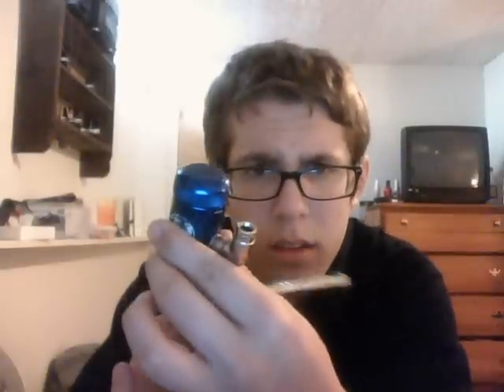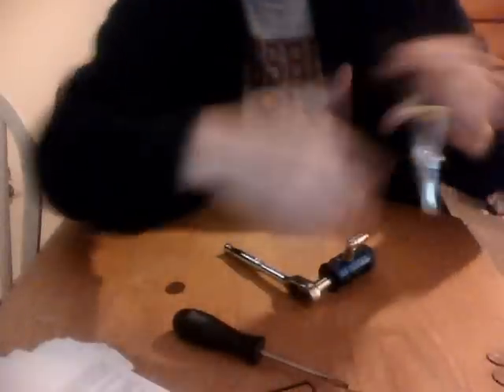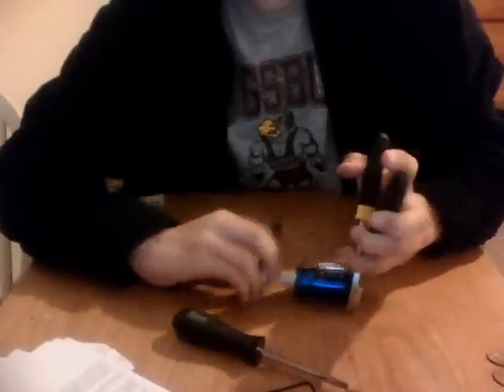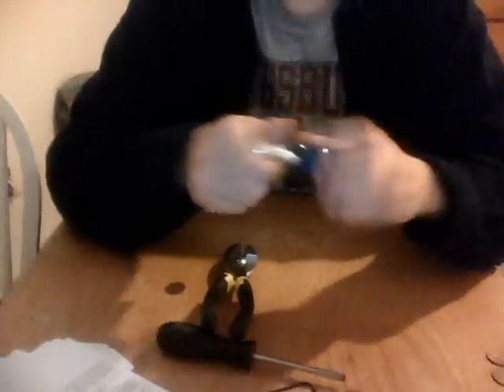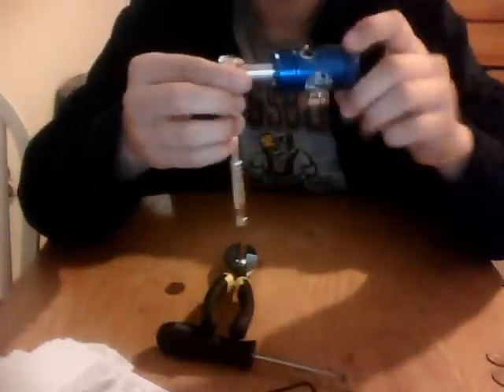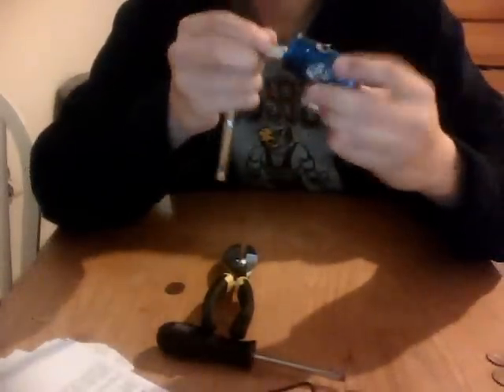You're going to take it and you'll see that it spins. So you stick that in there, take your pliers and hold the knob. While holding the knob, you're going to screw this out all the way — spin it out like that, all the way. Make sure you have it on the right way too, that would really help. Turn it, set this all in against the body, and just spin this until your pin falls out.